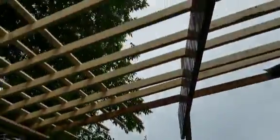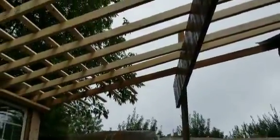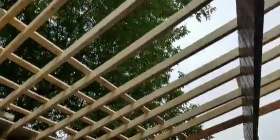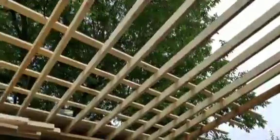And as you can see, it's at an angle coming down so that the 2x4s cross it at a different point. Like here you get most of the span of the 2x4, and then there it's almost splitting the 2x4 span in half. And so I'm putting them 1 foot on center because there's such a long span in places, and it's a shallow roof. And same with the battens, I think they're called.